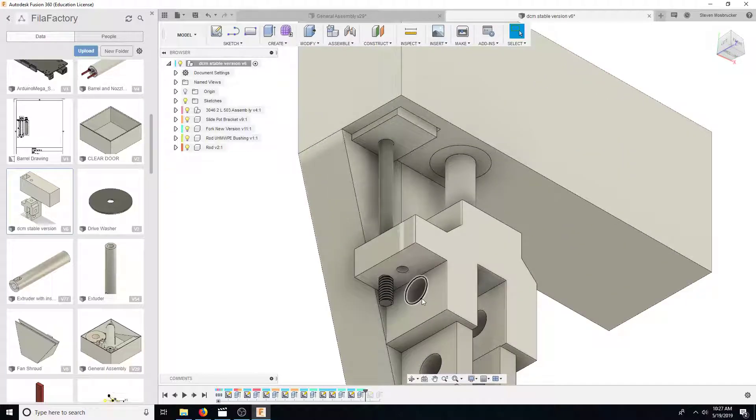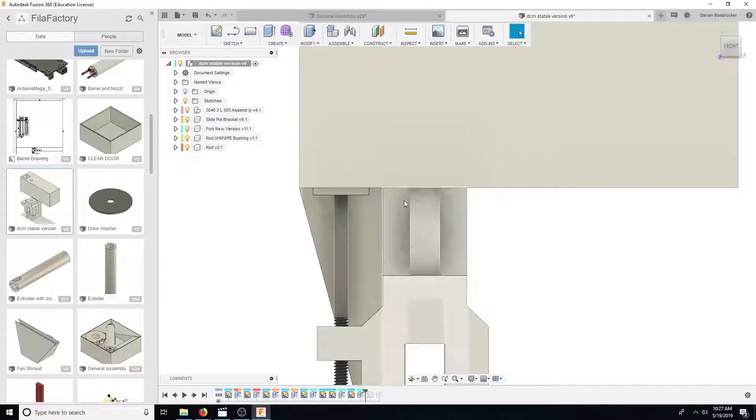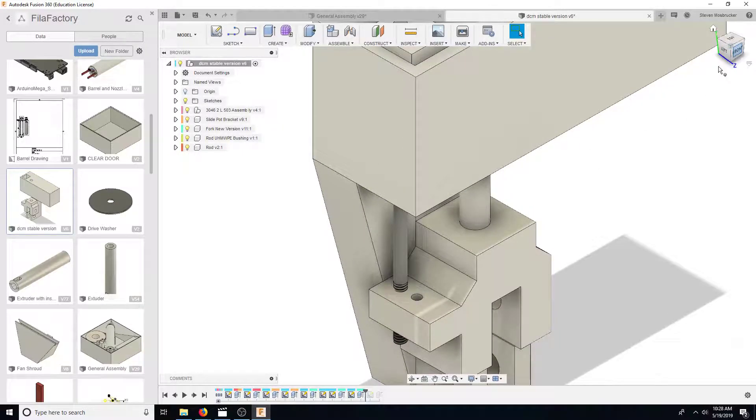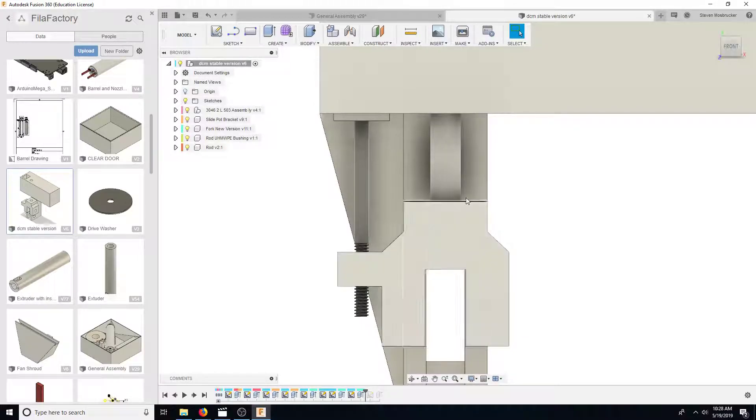Here is the LMP — linear motion potentiometer — and it's threaded in. I'm actually going to have it threaded in higher up, because there's not enough room down below. There's an eighth-inch steel rod here that goes through, and this guy is glued into the back. There will be a spring here that pushes this into the filament, so when the filament pushes on this it keeps it pre-loaded. This guy is going to be pressed onto this flat piece, which will probably be machined or sanded flat so it's nice and smooth.